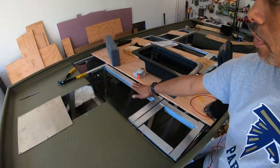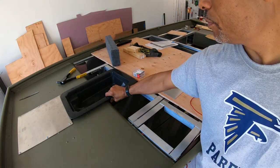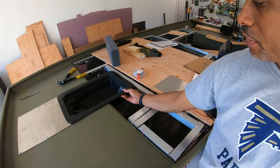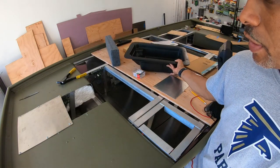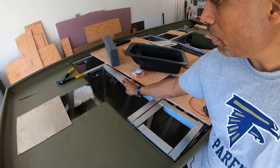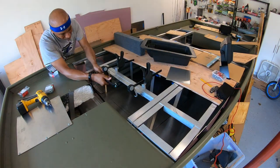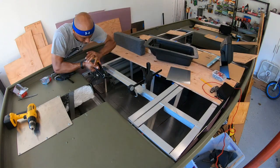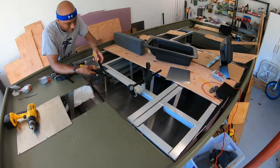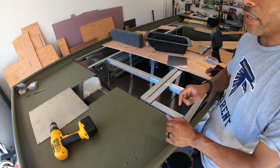What I want to do is install a metal piece of angled aluminum right here to support the tray. The back of the tray is going to be resting right there — just playing it safe, don't want any drooping or any kind of issues. Put a 1x8 piece about right here and we're going to rivet that in. All right guys, that's done. Completely solid, not moving. I'm very happy.